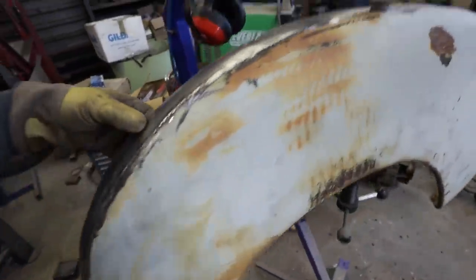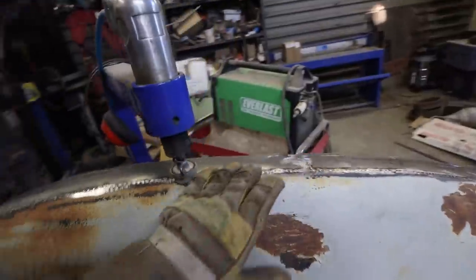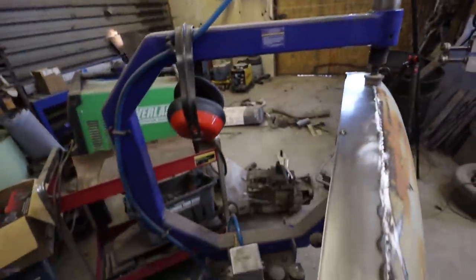So I was pretty much just walking this through the planishing hammer. It's kind of loud, so I won't show. But I was just getting rid of this hard edge because it kind of had a sharp edge, and smoothed it out, added a little bit of roundness to the top of here. I have almost no pressure on the hammer.